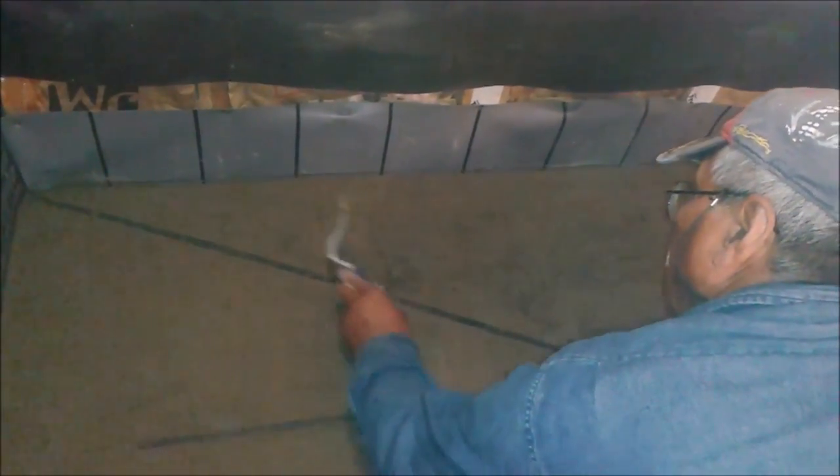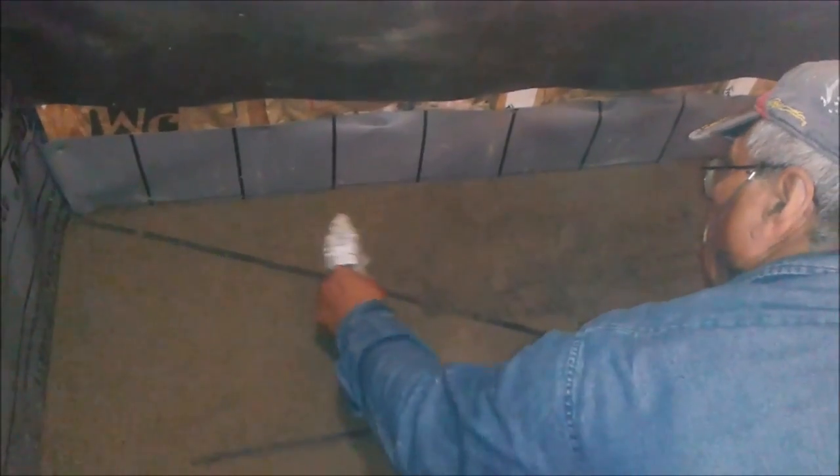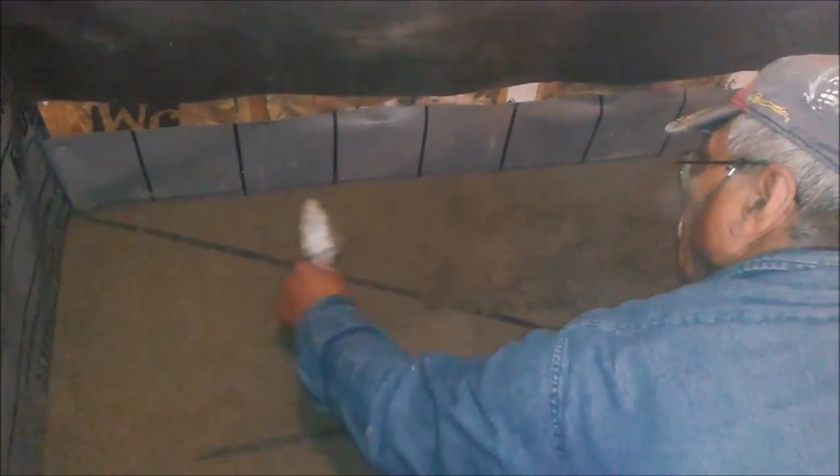We finished two slices here, but this is another piece of the shower. I call it a slice because it is divided into a different part with a stick. You can see what we are doing here — we are moving excess mud toward the center, and with that we are creating the slope by using the sticks as references.